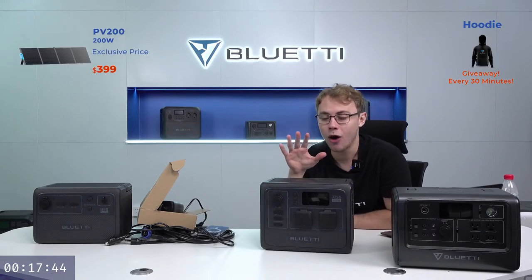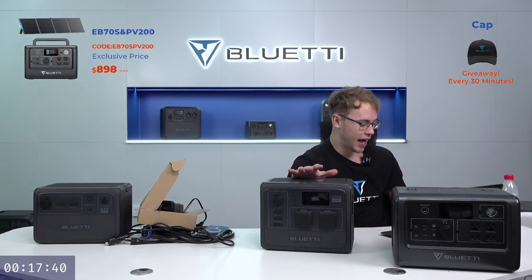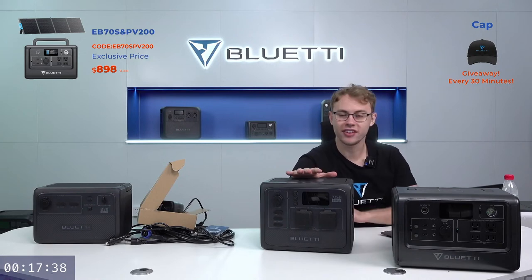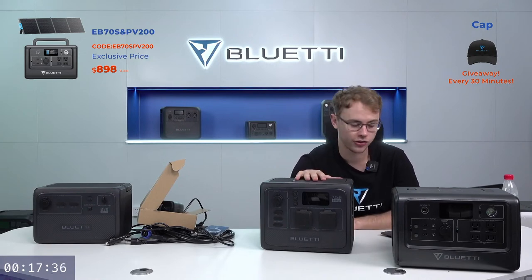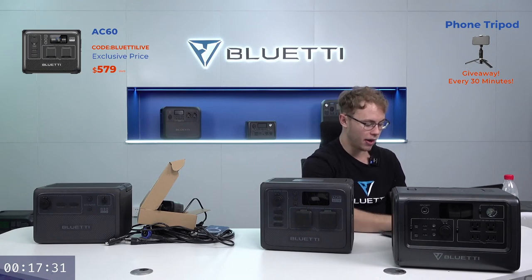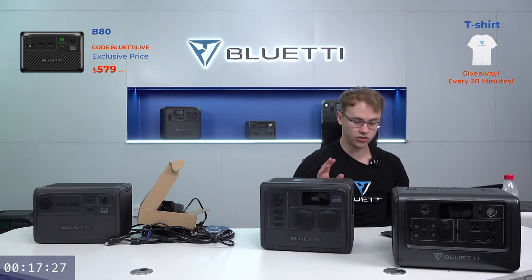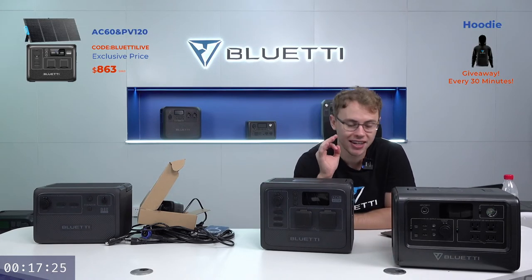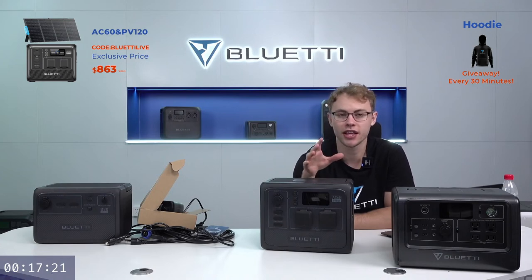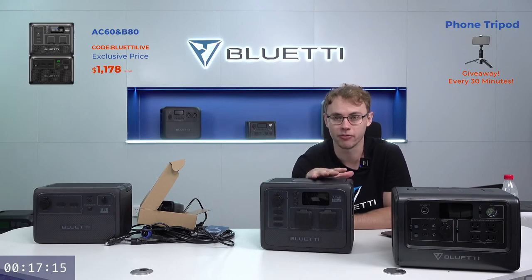Okay, how about AC60? AC60 is rated at 3,000 cycles. So again, let's do the same trick. 3,000 divided by 365, and we've got 8.22. So again, it's almost 9 years of runtime. And realistically, again, because we won't be using it every single day, it's actually more like 10 to 12 years of runtime. AC60.